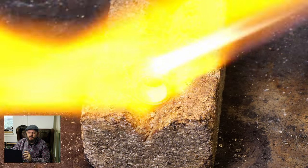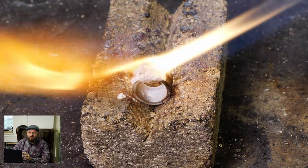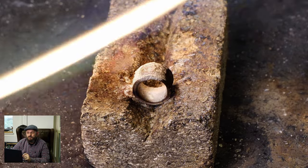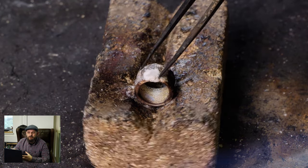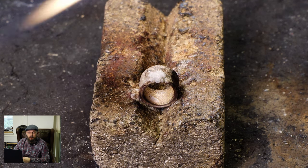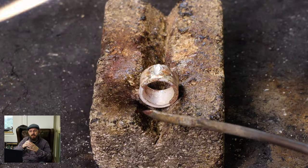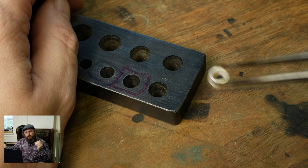This is a silver collet, by the way. It's soldered with the fluorescent yellow looking liquid as the flux — and solder is silver hard. At the moment I'm just warming it up evenly; the solder's got a little bit of flux on it so that's why it fizzes up when I place that on, but it just holds it in place nice and tight. I'll warm it up again, going around it gently, and when it comes to the main heat I'll bring the flame from around the back so the solder always pulls towards the heat.